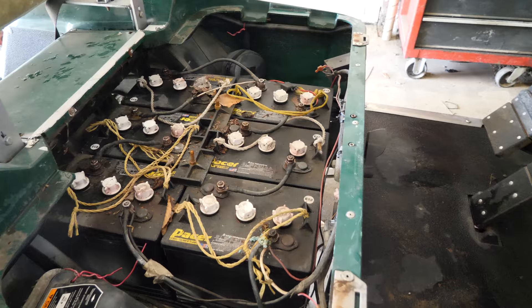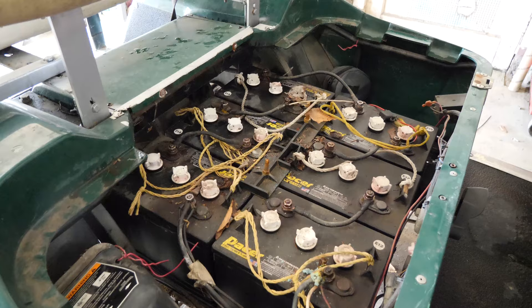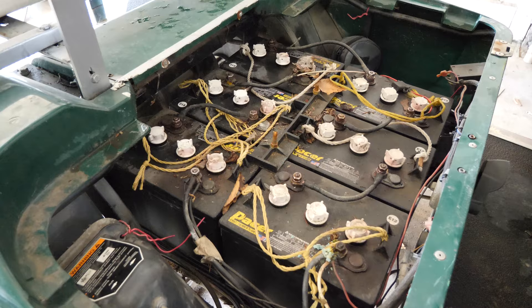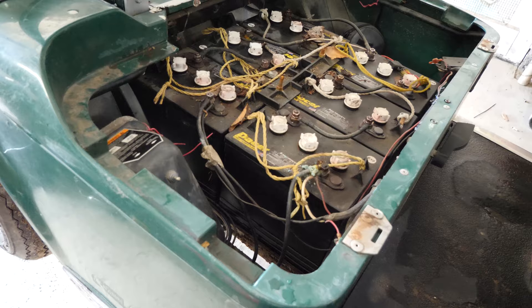What I did was I took my Flight Systems Industrial Products battery charger, which will actually charge a battery pack up from as little as two volts up to fully charged. We let it sit on the charger for two days — it's a high-frequency charger that maintains the pack. I let it sit for 24 hours and then checked the state of charge of each cell, and there are no dead cells. There are a couple of semi-weak cells, but they're passable, just barely.